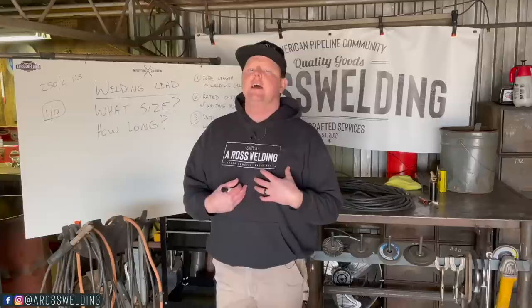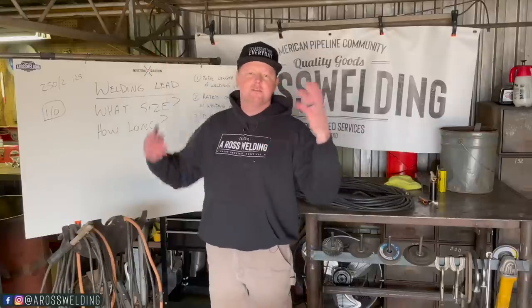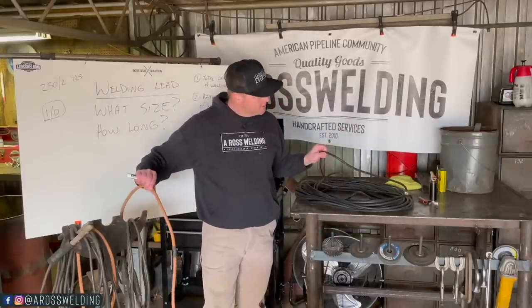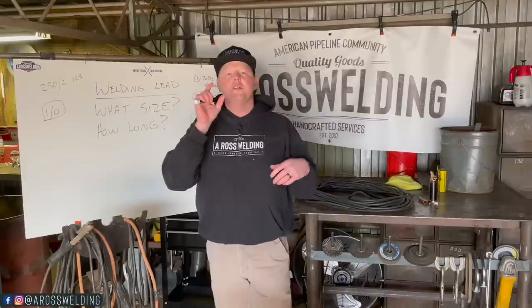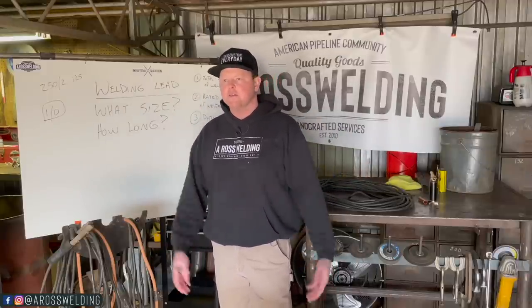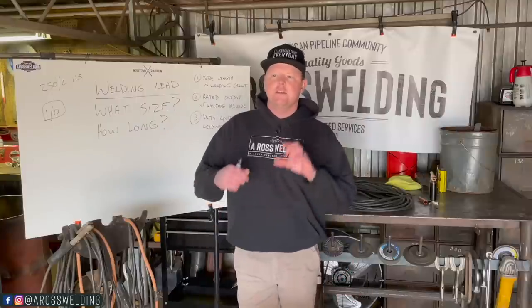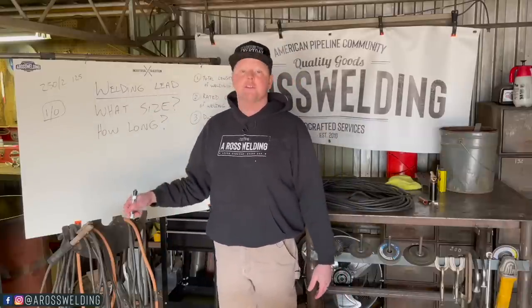You can try to be tight like I have over the years, and I know from experience that doesn't always work out. If you're welding on barns and stuff, you can get away with something like a number two — about 100 foot — because you're only making a one or two inch weld here and there and only welding with one-eighth welding rod. But whenever it comes to welding heavy stuff all day — equipment repair, heavy wall pipe, half-inch or three-eighths plate on up to two-inch bevels — if you're doing some hardcore welding all day, I really recommend getting the proper size of welding lead so it lasts you forever. This Ultraflex for a 1-0 is around $5 a foot right now, so it's really expensive. Get the proper lead for the proper application.